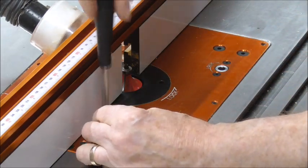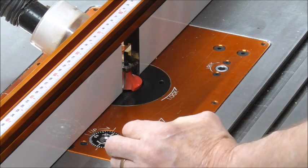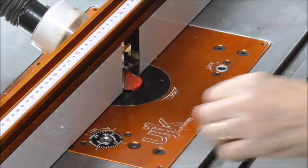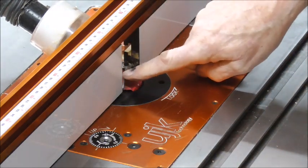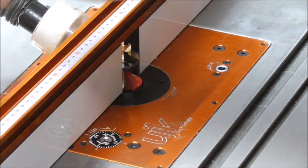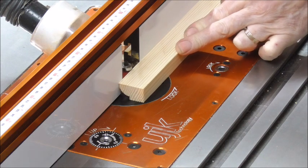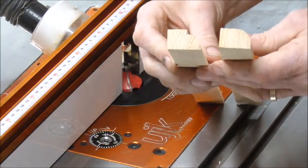So that it will give us that shoulder. That's good - just under the top - and what that does is it will stop the top giving me a line there, which I don't want. I want the line at the bottom. Put that to one side and we can compare them. As you can see from the same bit, there are two profiles we get - all we have to do is change the height of the bit, so interesting shapes.